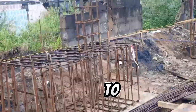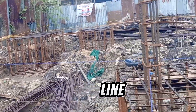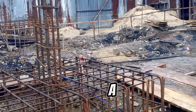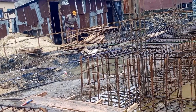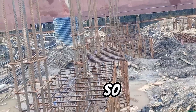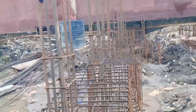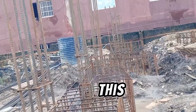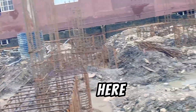Just look at this line too. Look at this line — they are in line. There's a blue rope there, a blue line. That is showing you that the starter bars are in a line. You can see this blue line — it's at the center of the columns. You have to be at the center to make these columns in alignment.